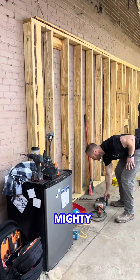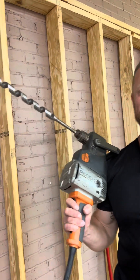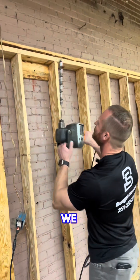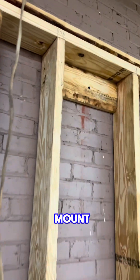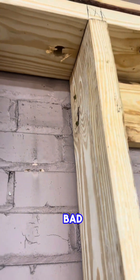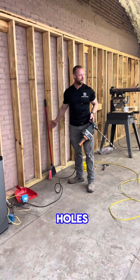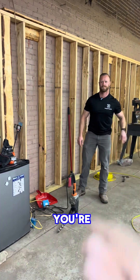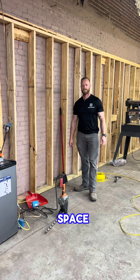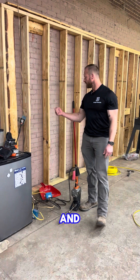This tool right here we use out in the field all the time to drill our holes. Rigid is close — orange and black — this bad boy we use for drilling. We feed our wires through there and mount our boxes. Paddle bits were great, but with this auger when you're roughing in a house, I'll have Kenneth or Grayson just start drilling holes. One person drilling, next person laying boxes, and we just go to town. If you're not on 16s or you're in a tight space, we'll pull up paddle bits if we have to.